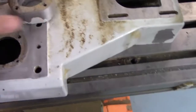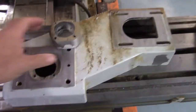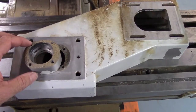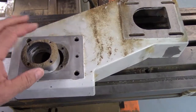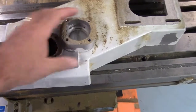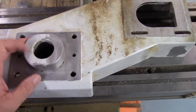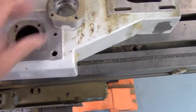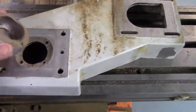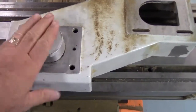Here's a shot of the y-axis servo motor casting that supports the thrust bearings. If you look here, the bolts that the bearing retaining ring bolts to come from the inside and screw into this pocket. They're relatively short, and I think if they would have come through more it might have helped. When you have a servo runaway, you never know what's going to happen.